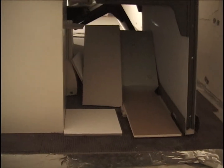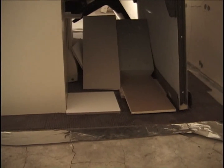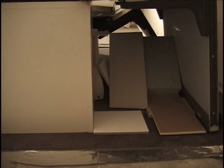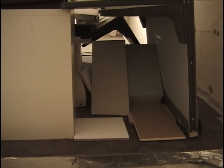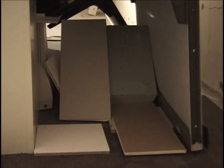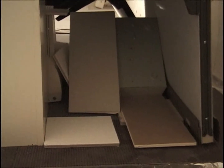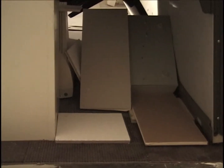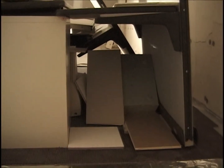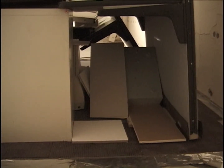Okay, looking at the northeast corner, we see drywall, we see the computer processor, tile, carpeting, and the edge here of the file cabinet that's remaining on this side. On the other side of the computer processor is the wastebasket, which is a major fuel item that is potentially going to play upward onto the underside of the desk, and maybe the only thing that does that. And it's only catching one outer corner of it, the northeast corner of the big desk surface.